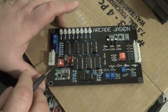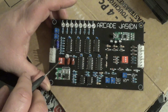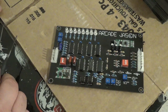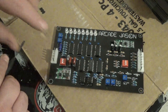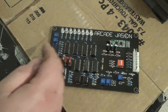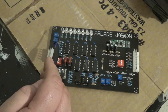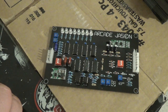And these dip switches here control whether you want the vector correction circuit enabled or not. Now, the vector correction circuit is used for the Vectrex only. So if you're going to use this with an arcade machine, you want to leave these switches off. But that's it. Oh, and these LEDs. These LEDs are used for calibration purposes only, only with arcade machines.